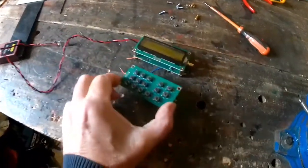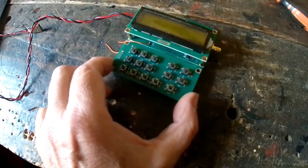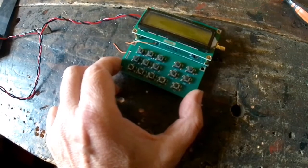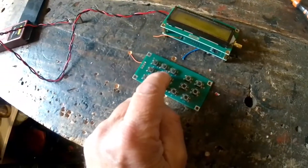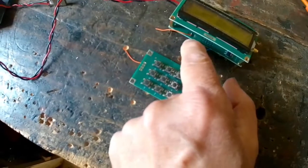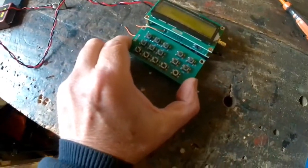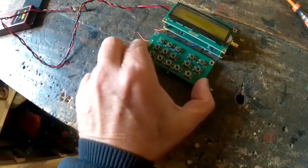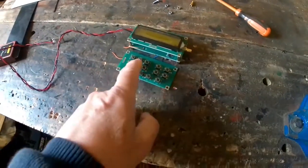Where that slot is on the bottom board, that's where I cut it down with a hacksaw. The intention is to mount the switch board up here — it only has two wires to this board. You can see the track there and the track there, and there's one on the other side. So despite what you might think, this switch bank only needs two wires, so you can get away with two flexible wires rather than having a rigid circuit board connection. I'll put some photos in so you can see what I'm referring to.